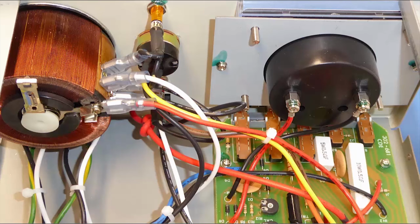And this is a final shot showing the PC board and metering area. A minor problem is that the black wire is touching one of the high wattage current sense resistors. Probably would not be a problem, but I will move it away from that component.